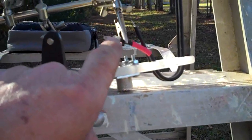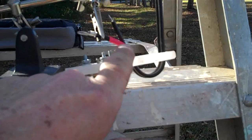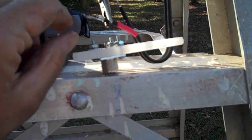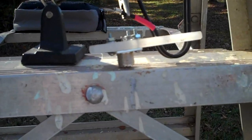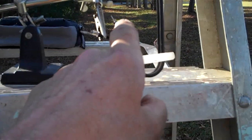I'm about to solder the connector on the end of the wire, and then I'll pull this heat shrink up and shrink it down. Then I'll fasten it to the screw — underneath the nut and the lock washer and the flat washer right here. Then I'll work on the second wire.